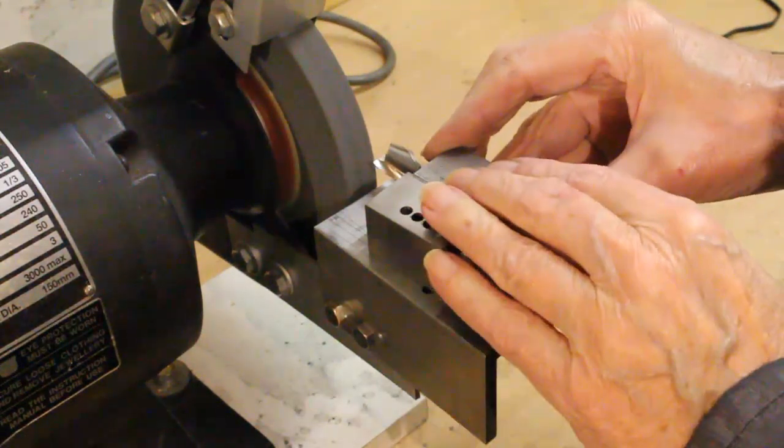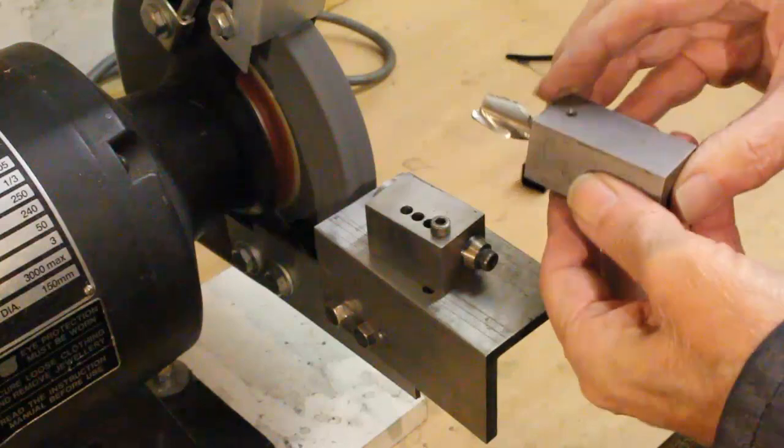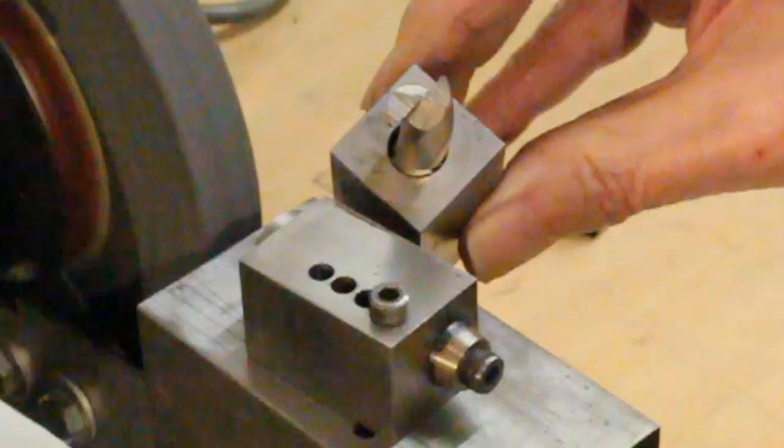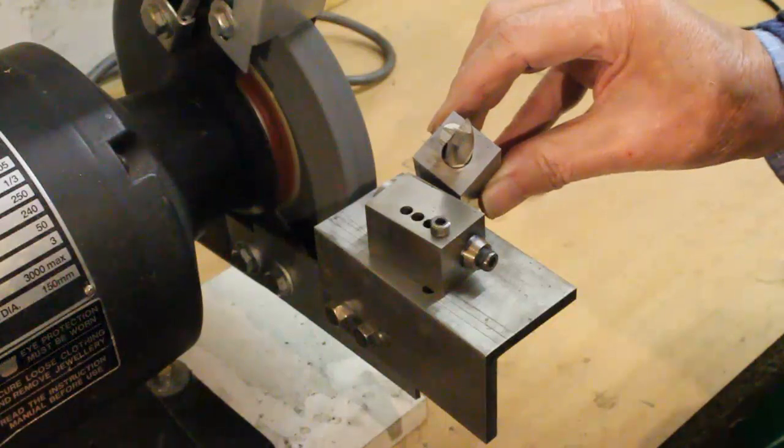Here we see the problem. That is, with one cutting edge being longer than the other, we have not sharpened it fully. If then the device was moved over to grind the one edge fully, almost certainly we would end up with the two tips at different levels. How then do we overcome the problem?